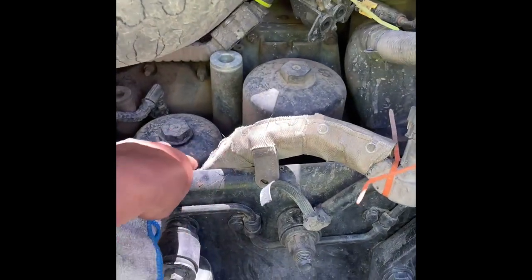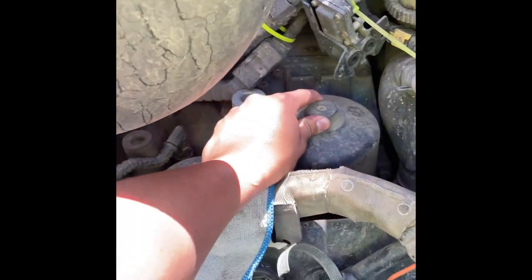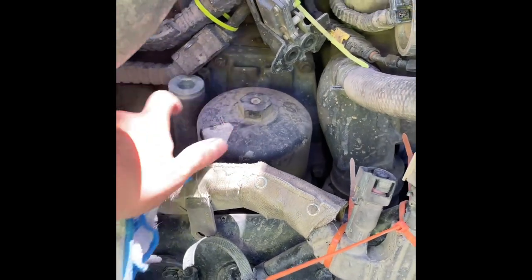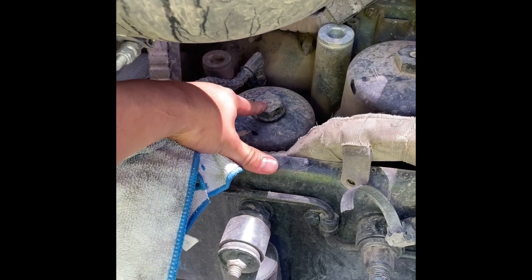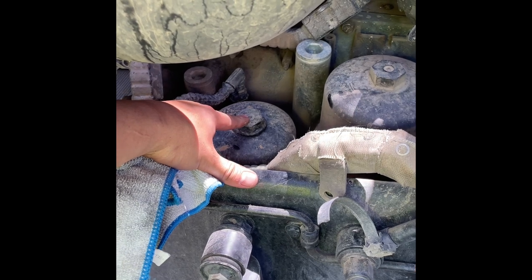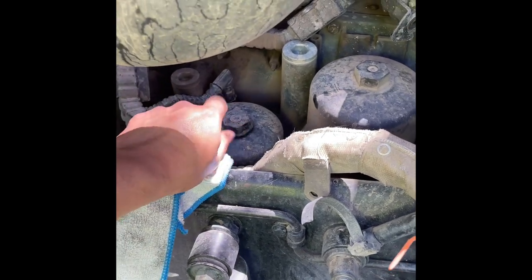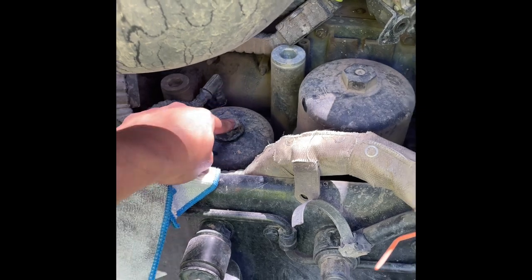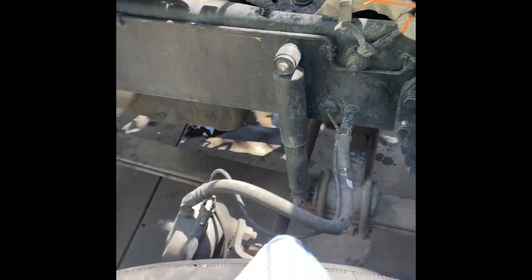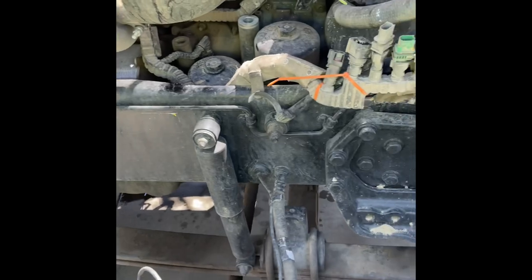Now let's go do the oil filters. These are the two oil filters — it's a big 32-millimeter socket, I believe. I'm just gonna unscrew those and pop the new ones in. There is a spinner filter bearing in this one that we're gonna double-check; sometimes they come loose. We might put a little Loctite this time so it stays in. Got my socket — inch and a quarter, half-inch wrench — gonna bust it loose.